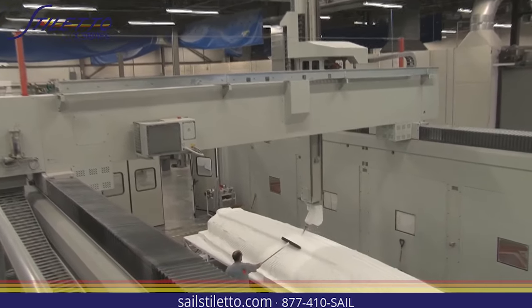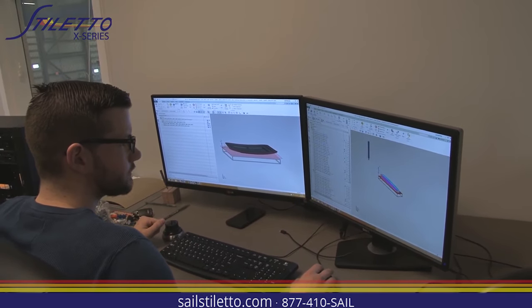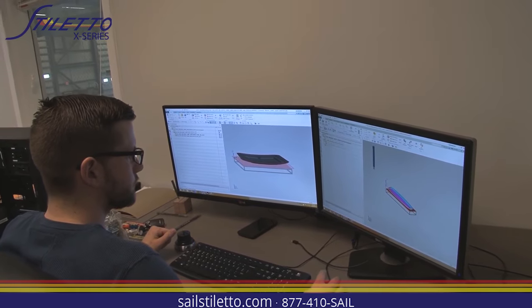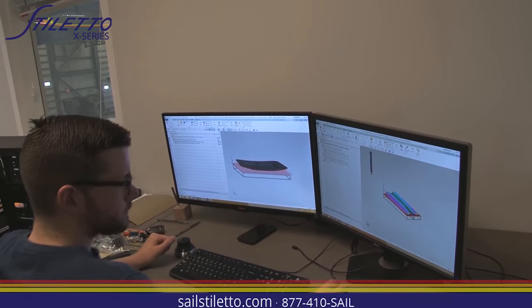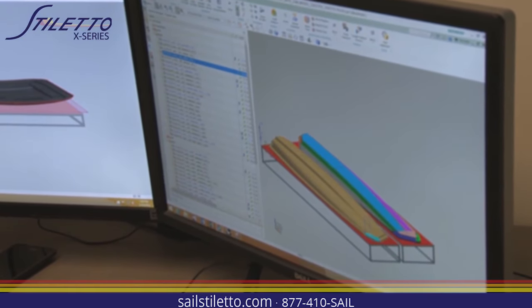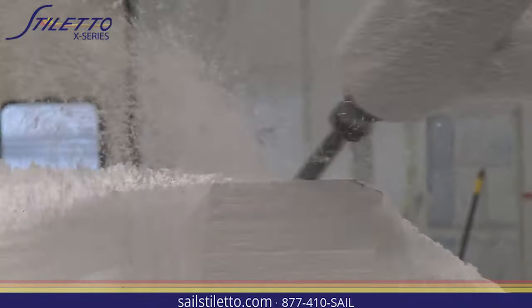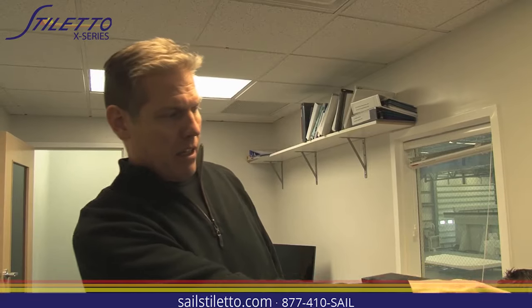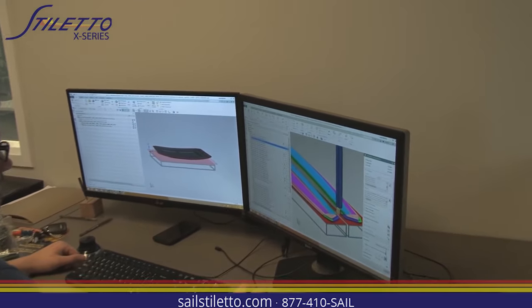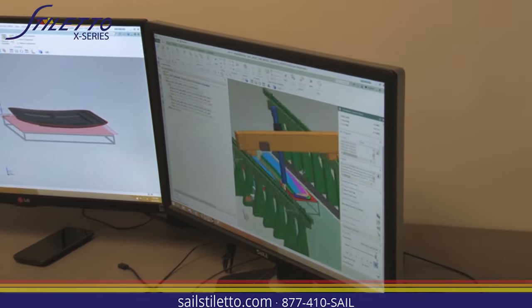How do we actually give this huge machine its instruction on how to carve the surface accurately? That screen on the right is a rendering of the Stiletto hull outer shape in its three-dimensional format. What we've done is taken that same surface and turned it into a machine language — the software's instruction on how to toolpath, or create a code to machine the actual surface, telling the machine to go from one spot to the next spot, turning a three-dimensional model into an actual accurate surface. You can see that Jeff just brought the mast in, and there's the job virtually running in the machine.